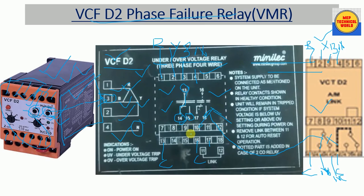In the normal de-energized condition, terminal 14 is NO and terminal 15 is NC with terminal 13 as common. When this relay gets energized, its contacts change: the NO contact becomes NC and the NC contact becomes NO. That is why the diagram shows the energized condition. Always read the circuit diagram or wiring diagram before starting the connection.